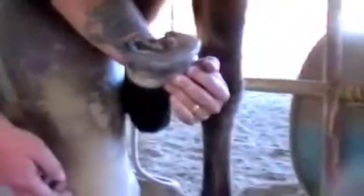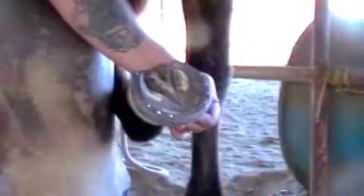This portion of the foot — you see, I can slide my finger all the way underneath the inside web of this shoe because I've taken the round part of my hammer and beat the inside web of the shoe up. And if you look at this part, there are no gaps here. So basically all your pressures are on the sides. That's a pretty well-fit shoe — no big gaps, nice short break-over.